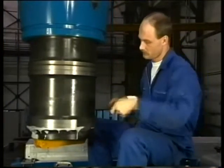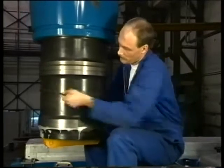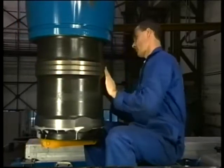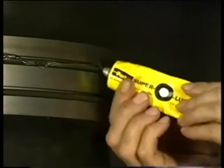To prepare the cylinder liner for assembly, the sealing face must be clean and undamaged. After cleaning the o-ring grooves, always fit new o-rings to seal the engine cooling water space. Lubricate the o-rings with the prescribed grease to keep them in good condition.